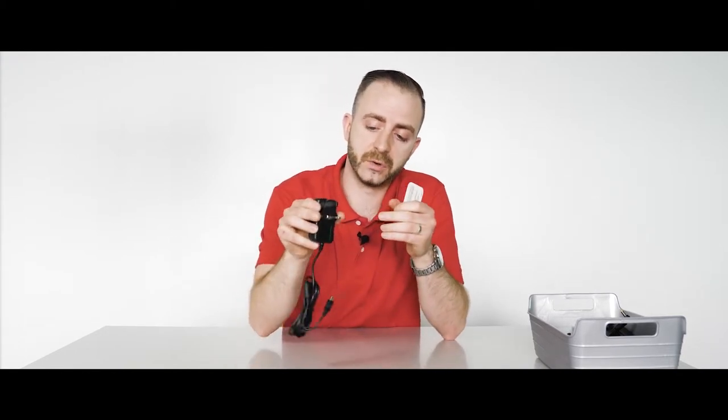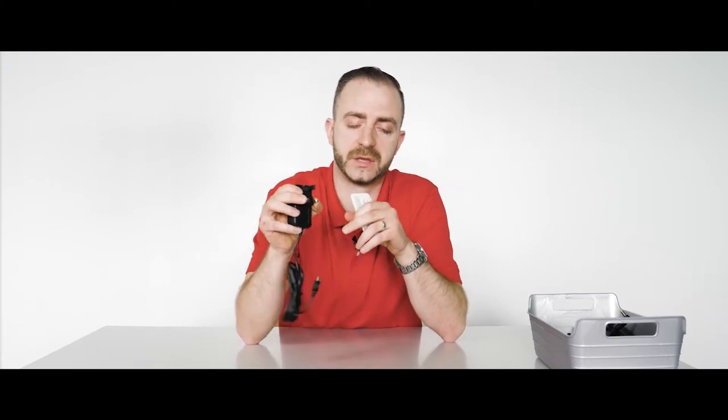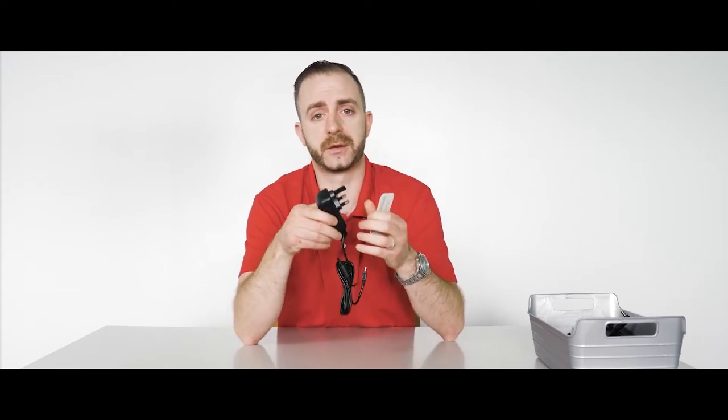The reason being: when you go to unplug it, your thumb and finger could slip around and touch the live and neutral pins, connecting you directly to mains electric — which nobody wants. It's not a good thing.